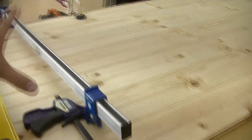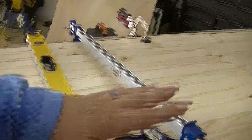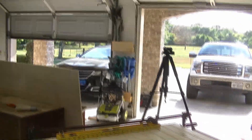As you can tell, I got everything clamped down using just what I had — just squeezing this together, and then I got this over the top of it squeezed down. That way there's no bow in your door, because once you squeeze them together you'll create a bow. Then I have another one over here at this end, and the T-track clamps here and there, as well as ones squeezing on each side. So we'll just let this set up for now.